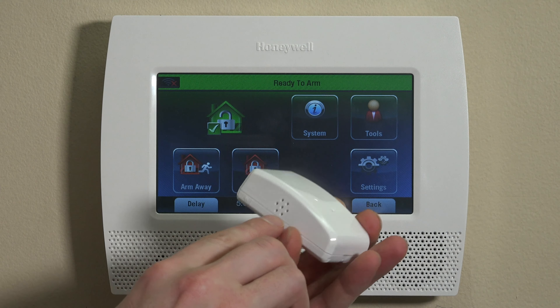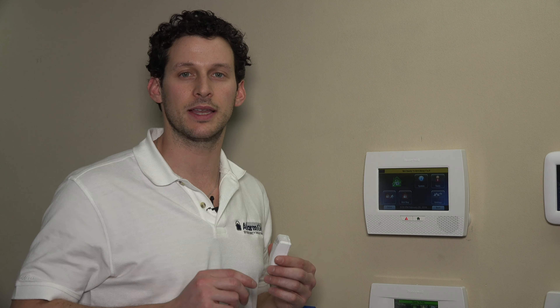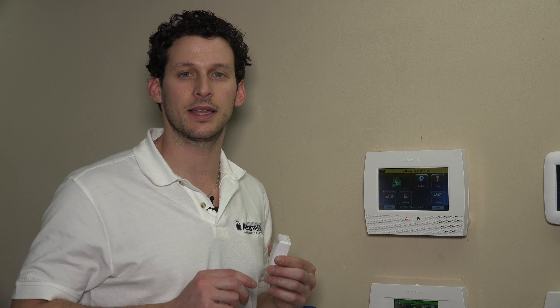So now what we can do is program it to the panel. But just to finish up on the install side of things, this is going to wall mount to a ceiling within three to six inches of your smoke and is simply going to listen. There's a microphone built into it and it's going to listen to the specific frequencies that the smoke detectors give off. All smoke detectors have to give off a specific frequency based on fire code, and that's why this will work with just about any smoke detector.